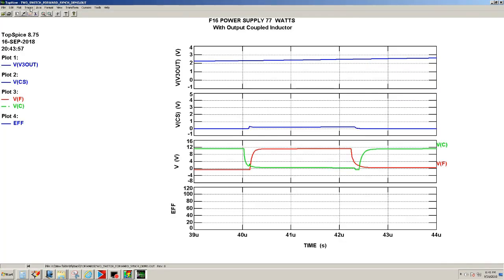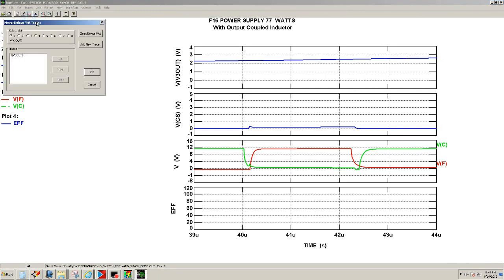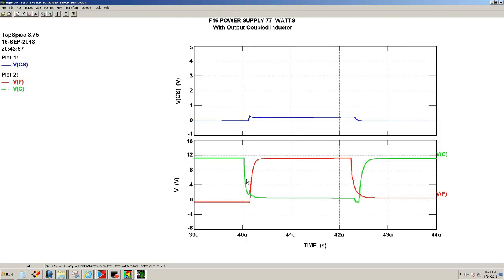Okay, and let's see, go ahead and take the other ones off. This one. Okay, so now you can see that there's a little gap in between. So this is the dead band. Okay, now there's still a little bit of cross conduction, but because this doesn't discharge as fast, because the capacitors, or actually the MOSFETs, are huge, and I'm going to go ahead and cover that in the next video, but I want to make sure that you see that.